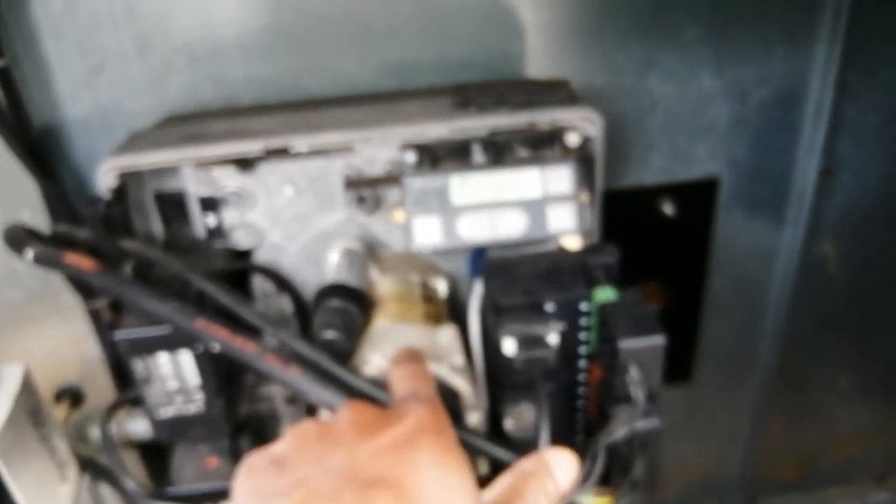That's it on this model. Send me some comments below if you've ever worked on this Washup unit or any others, or if you've had problems trying to find what is tripping the MCB — the miniature circuit breaker — and what you've done via route of elimination. I didn't imagine it would be the capacitor; I thought it would be something heavier like the ECU or the fan motor. But it was the capacitor that appeared to be at fault.